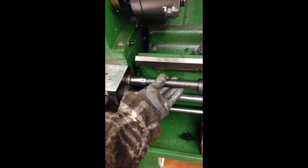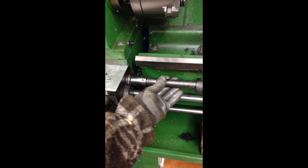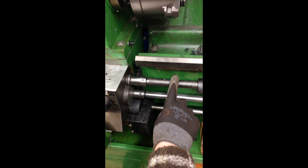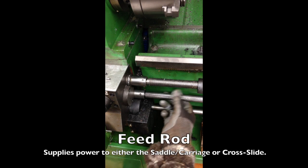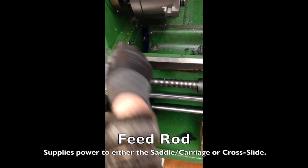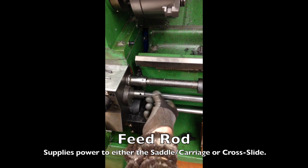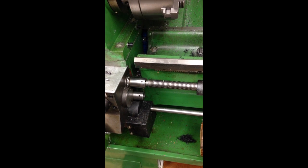So we can move this, but we can't move it any further than that because the rod end cap prevents it from coming out — I'll show you later. The feed rod is exactly the same, it has this horrible spring pin in it, so replace that as well. This one can be pushed right out as far out as you can.